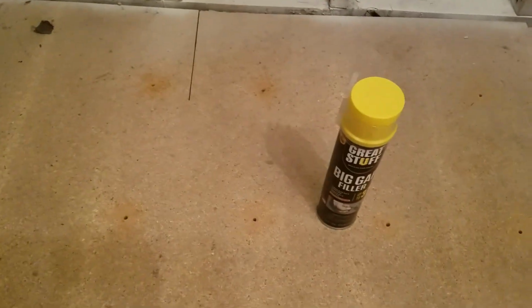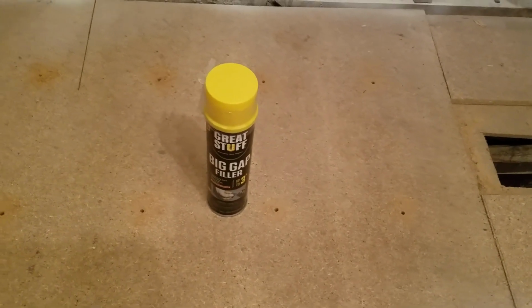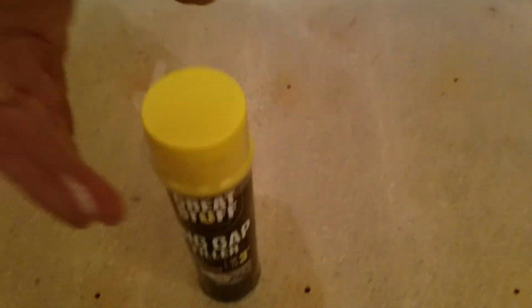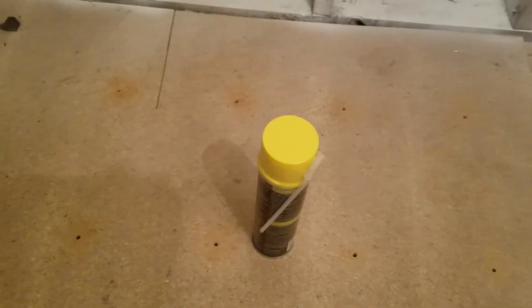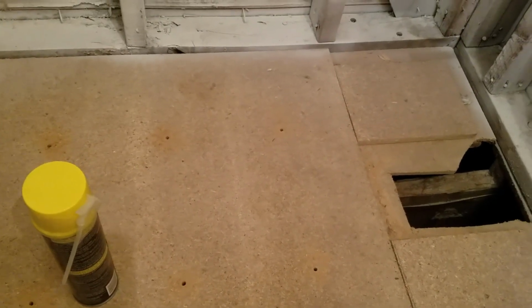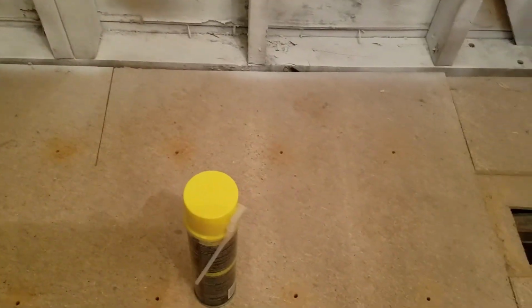So I've drilled 8 holes underneath where the tub goes. And after I set the tub in, I'm going to come up through the floor with the 1/4-inch tube. It's actually like 3/16. I'm going to stuff it up through these 8 holes, and I'm going to fill the thing full of gap filler foam. And I've got 2 cans, so should have plenty. And that will provide a lot of support underneath that tub. Not that it needs it. The feet and the plywood bottom actually do all the support structure, but I'm just going to put that in there as an added helper.